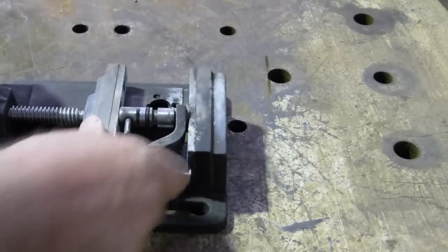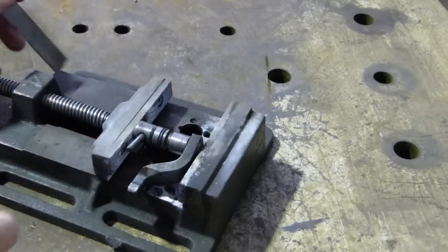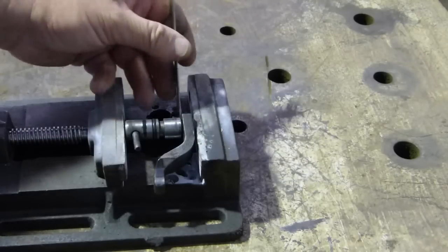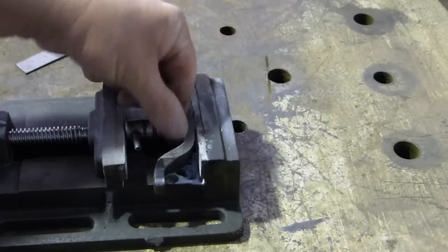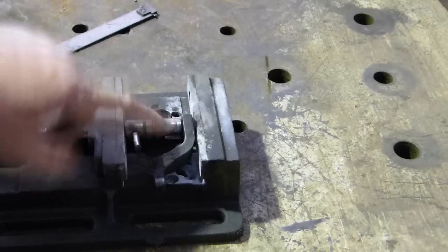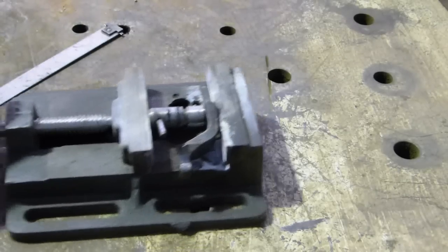This is just an old drill vice we have that I do a bit of welding on. There's a gap down in here and that looks to be about as thick as the ruler all the way around, so we're going to call that okay. What we need to do now is just for safety's sake, I'm going to put a couple of witness marks here and here in case things get out of whack a little bit, so at least I've got a chance of finding where I was before.